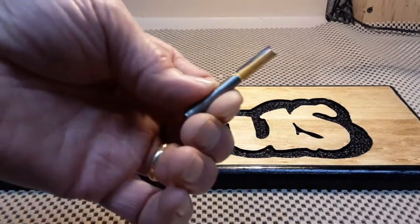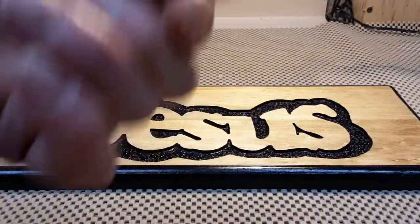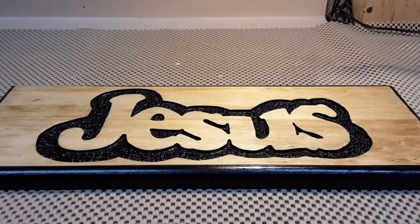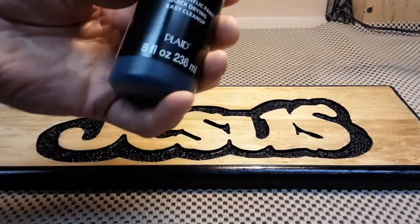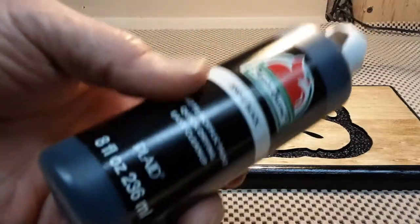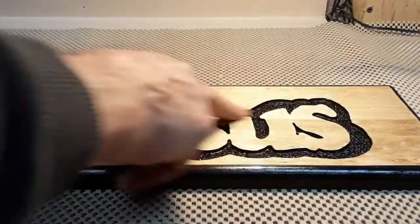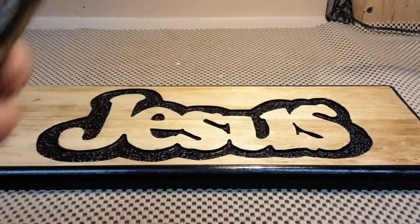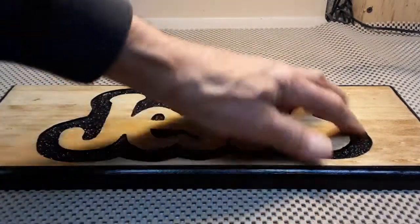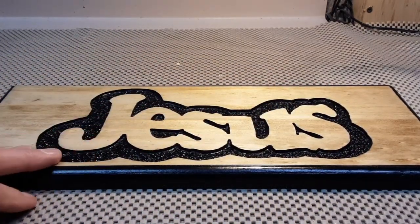And then this quarter inch straight bit, I didn't put it in the description. You can just get these at any big box store for your quarter inch router. But anyways, here's that acrylic paint. You can get this at Walmart or Hobby Lobby. This is good for smooth surfaces, but if you're going to do any of the texture stuff like I did, where I ran into a problem, it doesn't cover well. It dries fast, but that's about it. I would use aerosol paints. This way it'll get into all these textured areas, and you won't run into a problem.